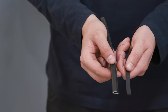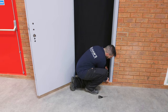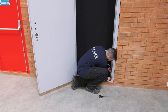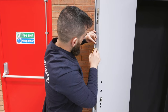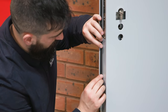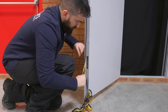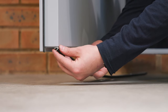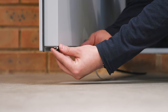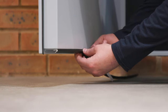Included with your door set will be two types of black seal — one thick and one thin. Apply the thick seal to the door frame with the V pointing towards the inside, and the thin seal to the door leaf around the full perimeter of the anti-jemmy bar lip. Don't apply any to the threshold, as the thin seal applied to the bottom of the door leaf will create a seal here. We also recommend the remaining thick frame seal being applied to the bottom edge of the push side of the door leaf, as this will assist with preventing driving rain ingress.